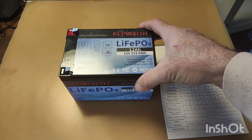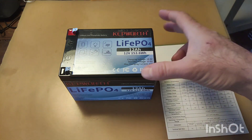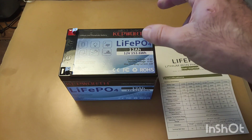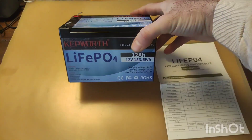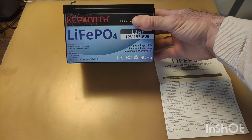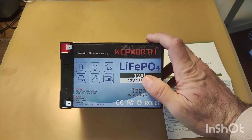You should stay above 2.5 volts, which is why using this battery without an external discharge controller is not suggested. I will be using a built-in external module which is set to not go lower than 12 volts — that means 3 volts per cell, or about 80% of discharge capacity down from 3.65 volts. I will be charging it at 14 volts with power from my electric vehicle, and testing the battery to find the real capacity and potentially ask for a partial refund if it's below 12 ampere hours.